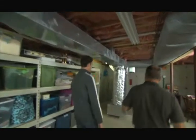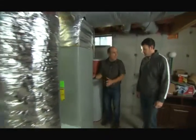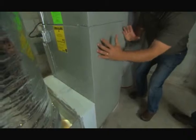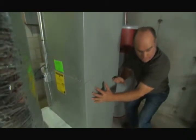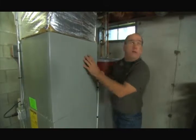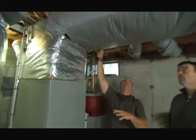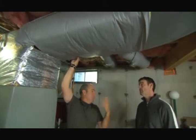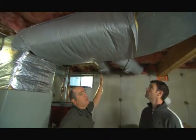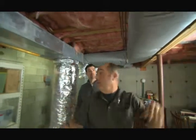So here it is — you have a gas-fired furnace. Inside this box you've got a blower down here that pushes the air up across a heat exchanger, which heats the air in the winter. Above it you've got an air-conditioning coil that cools the air in the summer. That fan pushes the air up into this trunk. This trunk right here is a supply trunk because it's insulated, and you can see branches that go out upstairs and all the way along.